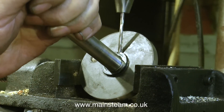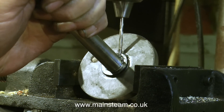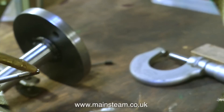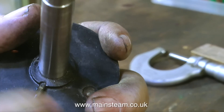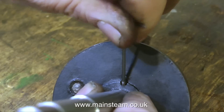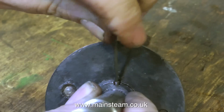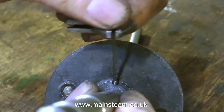While the crosshead is in the acid bath I thought I would take this time to drill and tap for the grub screw to go down into the crankshaft from the crank web. This makes for a very secure fitting — it's not really necessary but it's a real belt and braces approach. The grub screw now not only goes through the crank web, it goes tightly down into the crankshaft part way.